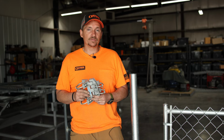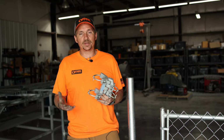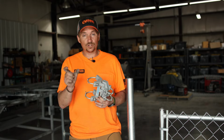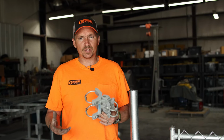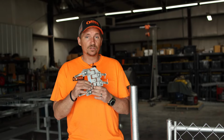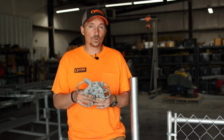Normally, the male and female hinges are roughly 2 inches. Now, we have some from different manufacturers. Some of them are 1.5 inches of space in between the gate post and the frame. Some are 2 inches. It just depends on where you get them. This particular setup is meant in the sweet spot for 2 3/4 inch.